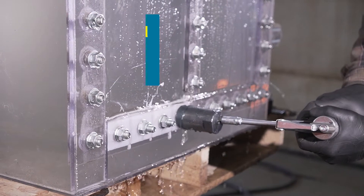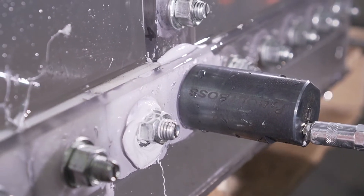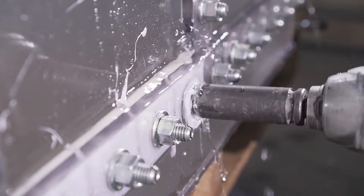How do you tell if you fix the leak if you drain it? We developed Bolt Boss and started injecting between the panels with a full tank. If it's full, you can physically see it stop. If you drain it, you're basically risking all that money that you just spent to empty it, refill it, and then not even be 100% sure that it stopped. You can see it fixed right when you do it, and then you know that spot's fixed.